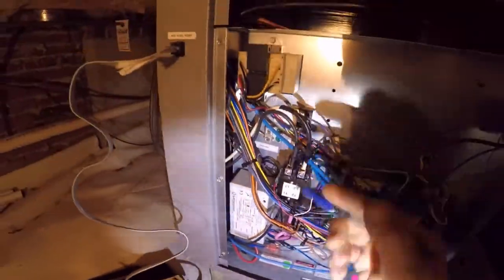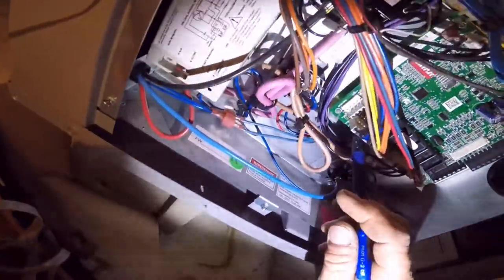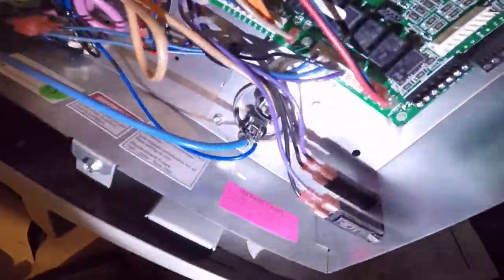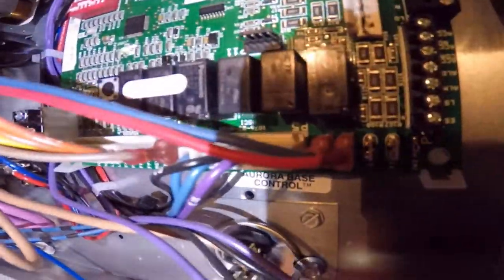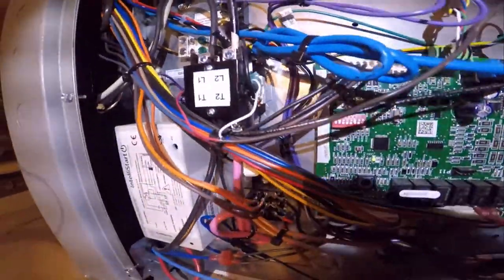There's not a whole lot to it — you got a contactor, a transformer, and a solid-state board. All your switches down here: low pressure, high pressure, freeze protection 1 and 2, reversing valve. Over here this molex plug is your compressor high and compressor low. Your high-low pressure switches, all your safeties, and your electric heat strips go into these terminals up top. I already got a wire running back there — you just plug it in. You can take your wire from the compressor contactor and send it down to the solenoid valve.